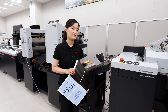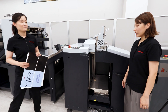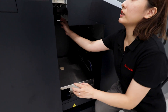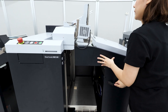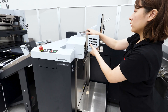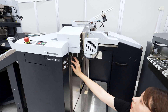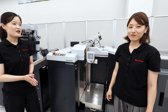Hirokawa-san, you just mentioned that it's very flexible to disconnect from the roll feed to the cut sheet. Could you please show us how it works? First, loosen this handle. Next, detach this bridge guide, and push the bypass conveyor like this. So easy. And lower this guide. And don't forget this double-feed paddle. That's done. Wow, I just blinked and it's finished. Thank you, that's very easy to use.